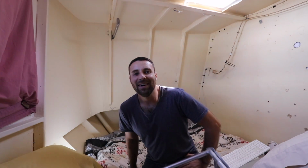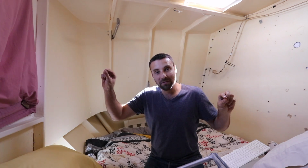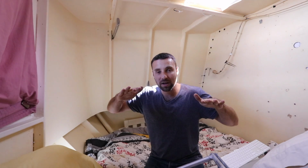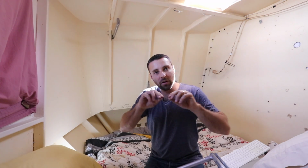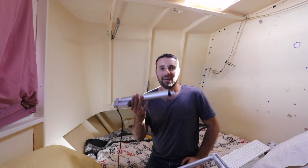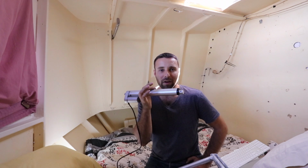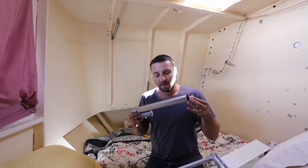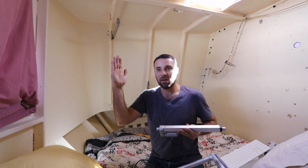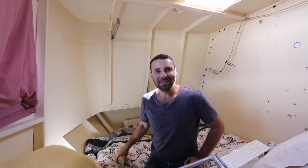are for a thing that I'm pretty pleased with. So I had a spring in there. I had a piece of Spectra rope as a safety stop, so if it all came apart it wouldn't crash down and chop your legs. And I also had it spring loaded, so it was effectively weightless because of the spring. Okay, this is a linear actuator, so basically think of it like an electric hydraulic ram. So this is going to be my new up and down mechanism. Push of a button, it'll go up, push another button and it'll come down. So let's get this installed and see what she's actually like.